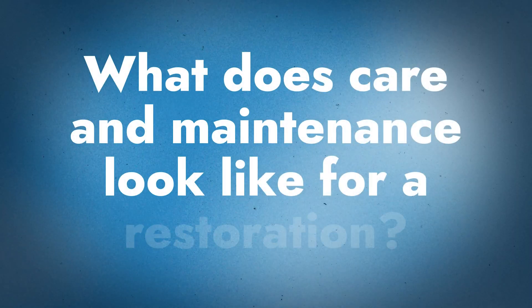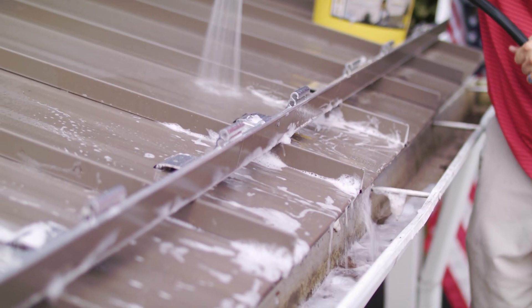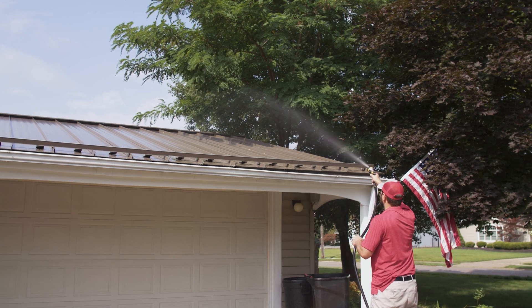We also provide a closeout book of care and maintenance along with the warranty. What does care and maintenance look like? There's not a lot you have to do — it's more about what not to do. Don't use certain chemicals or treatments, and don't pressure wash it yourself since high pressure damages roofing coating systems. You want to low-wash or soft-wash. We recommend a soft wash or rinse-down every five years. Avoid foot traffic on the roof to prevent oil transfer. The goal of a metal roof is that it maintains itself through normal rain wash.